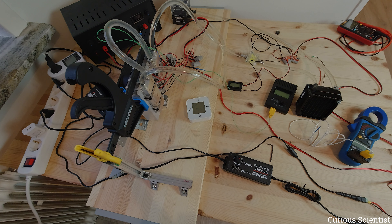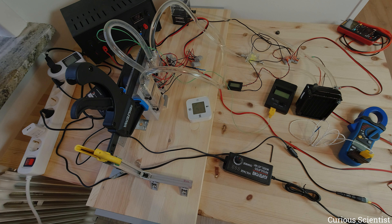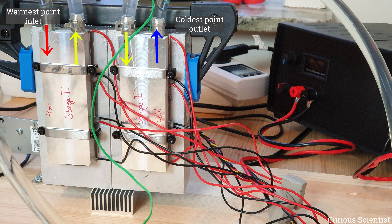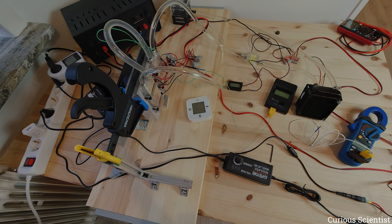What you see here is not a very difficult system. I made a water cooling loop which is being cooled by Peltier coolers — namely six TEC 12706 Peltier coolers. These are cooling the water inside this loop, and these six Peltier coolers are attached to two big aluminum heat sinks which are cooled by forced air from a high-performance fan capable of around 6,500 RPM. That makes sure the hot side of the Peltier coolers stays more or less cold.